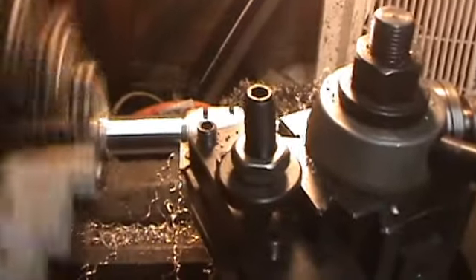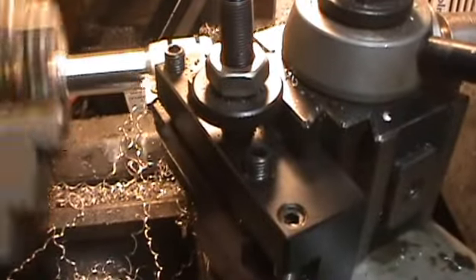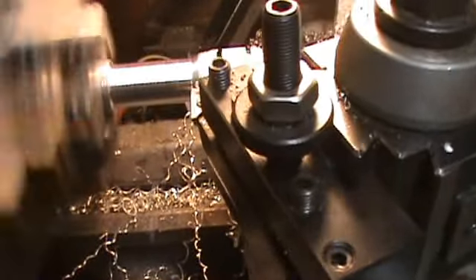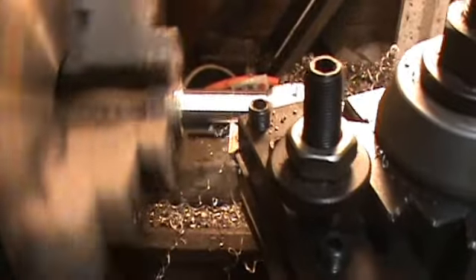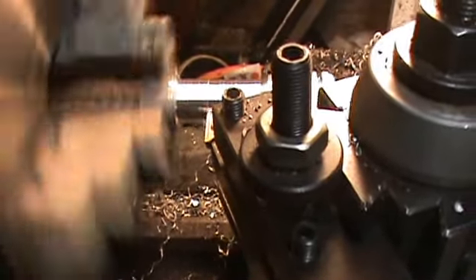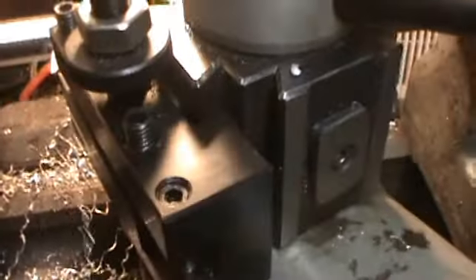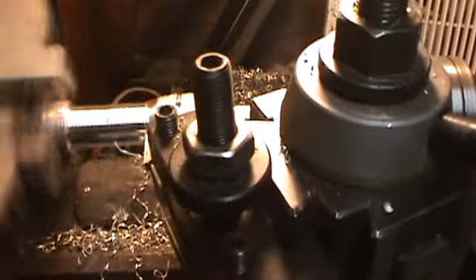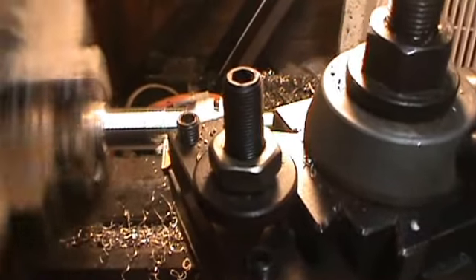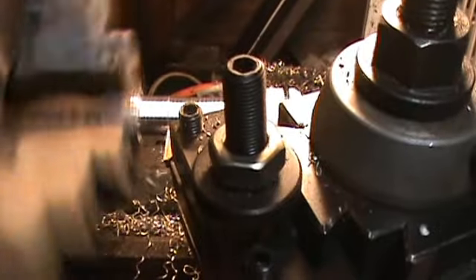Here's the faster speed. Let's take about another 10–15 thousandths. That's pretty good — there's some speed I can tolerate. It could probably go even faster but it's good enough for now. It's probably about 20–25 thousandths coming off at a pretty good speed. I'll just finish up this bolt and take a look at it.